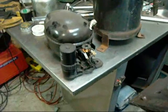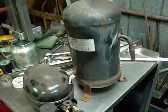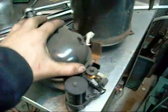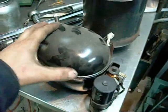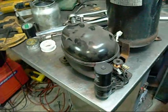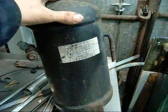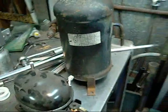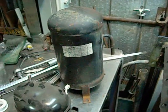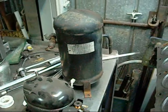When it comes to actually building a silent air compressor, it's really up to the user to determine what kind of air output they want, how much power they can consume, and just how big they want the whole package. This is just a tiny little compressor from — you could use them in a small water chiller or a slushy machine, some sort of very small domestic or commercial refrigeration application. And that's a liquid receiver from a large commercial meat chiller condensing unit. You can use a pressure vessel of your choice, just as long as it's rated to the kind of pressure you're putting into it — or at least overrated. If you want to put 200 pounds in it, make sure it can handle at least 300.